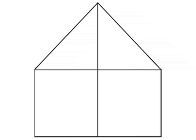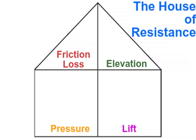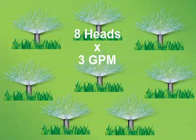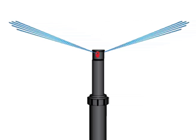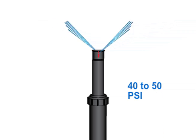For this sample application, we will build a structure we'll call the House of Resistance. This house has only four rooms — one each for elevation, friction loss, lift, and pressure. The House of Resistance starts with the 24 gallons per minute peak flow rate. We'll use 45 PSI as the required pressure in this example. The pressure required to operate a sprinkler head is typically 40 to 50 PSI, and can vary from one manufacturer to another.